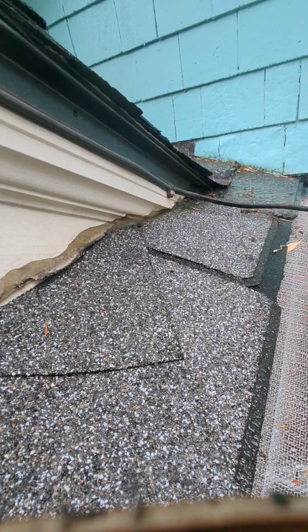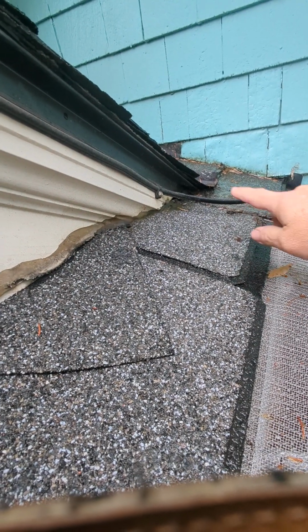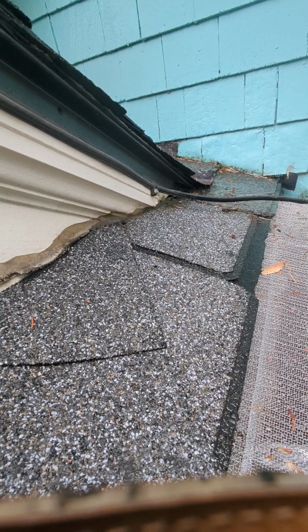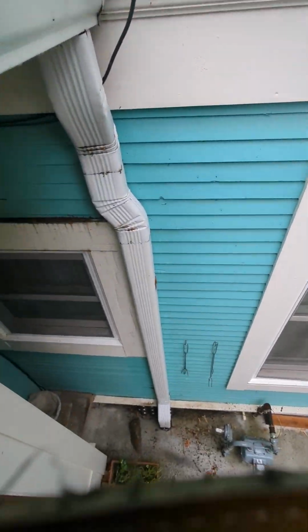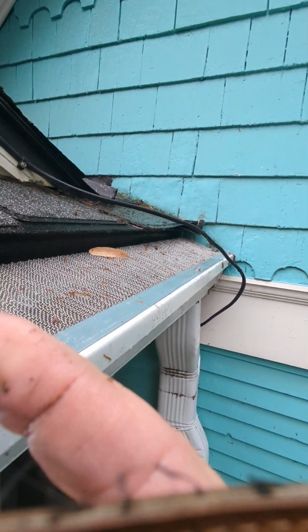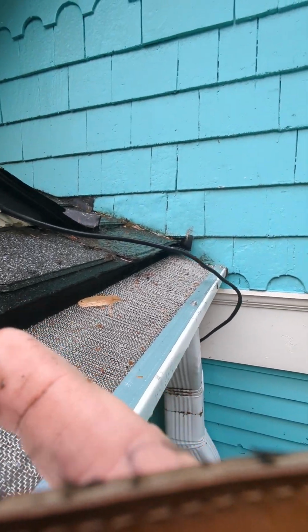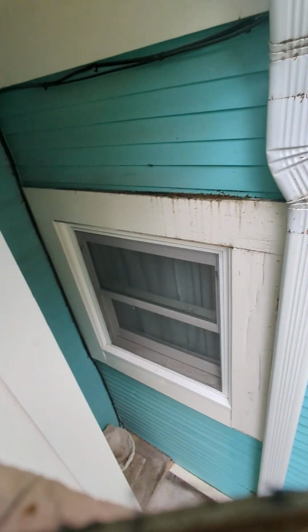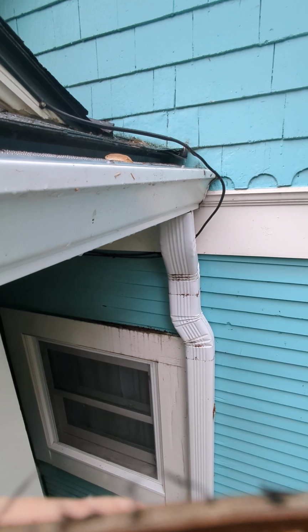When I got here, because it's raining right now as I'm up here, this was sitting down on top of, and it's for your DirecTV, or satellite dish, whatever you got. But water is sitting on this. You can see it's water right now. That water, surface tension runs that water, and so it was getting slow drips all the way in here, which I've pulled it off of everything now. So it's not touching anything. It should be only water landing directly on that wires going, but it was sitting on the roof. And when that's sitting on the roof, all that water coming off of here that you see dripping was running right down along that and coming in too. So your DirecTV stuff was kind of in the way, but I moved that out of the way for you, cleaned your gutter off, and you guys are good to go.